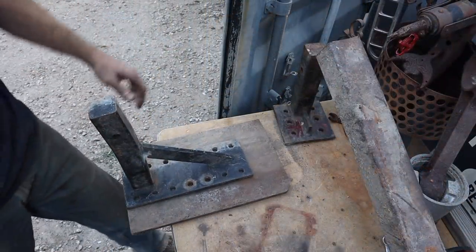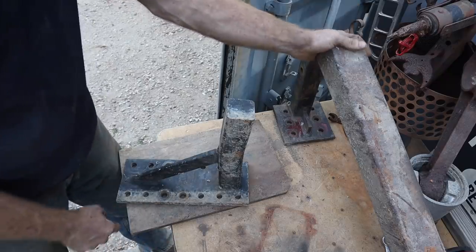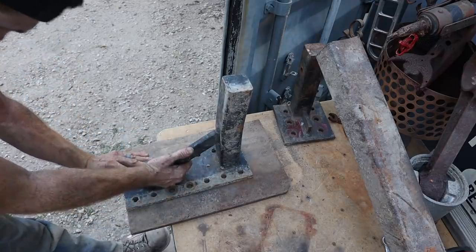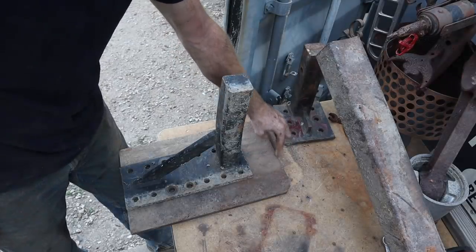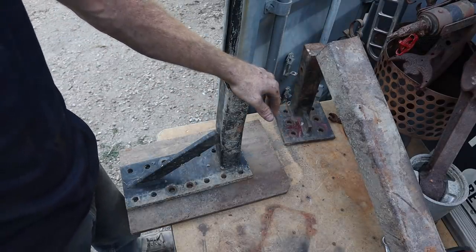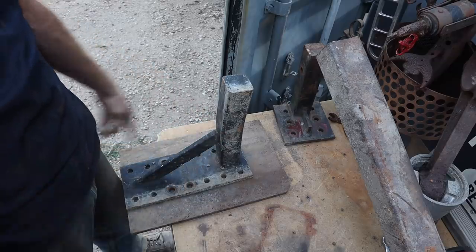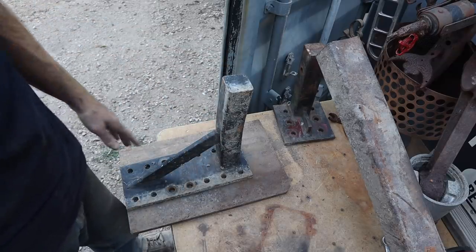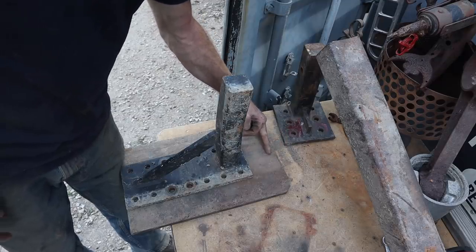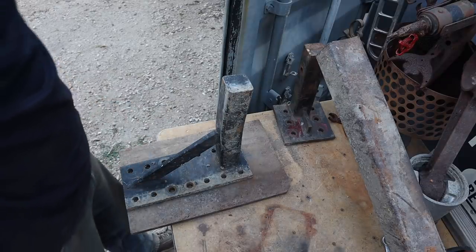So the other thing I need to take into account is the fact that where this is mounted, this 2-inch will fit between these holes and a 3-inch chunk won't. So I chose this piece because if I set this up all the way down like this and I center it in the middle, it'll give me enough room to weld my 3-inch chunk right there at the top. And then that way it will be able to be braced down the middle for added strength. And I may even go down to the outside corners and then one in the middle. I'm not sure how exactly I'm going to brace it, but point being is a 3-inch by 3-inch chunk can be welded right in that area and low enough that I can get a weld up along the top and burn that in nice and hot. So yeah, this will work well to be able to get those holes drilled.